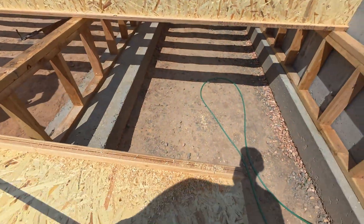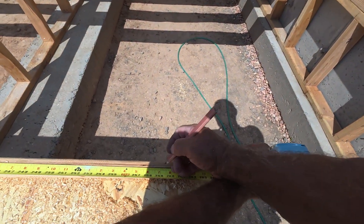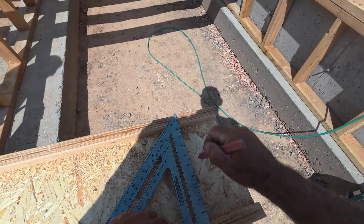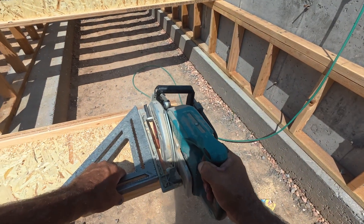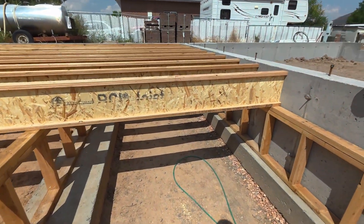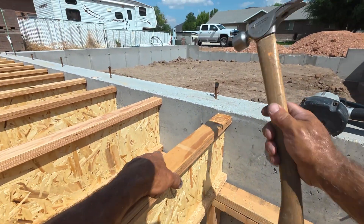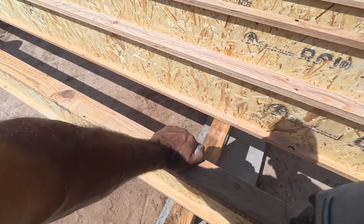Here's the cutter's point of view. You're going to hook your tape and try to keep it all the way across so it sits right on top of that joist. You're going to mark it on both sides, push your square over a little bit, get your cut on your first mark, make sure you cut straight all the way through, and when you get to your second mark make sure it's still lined up. Then we pick it up and drop it into place. There's going to be a gap on each end — me and my dad communicate the whole time every time we drop in a board to make sure we have close to the same gap.